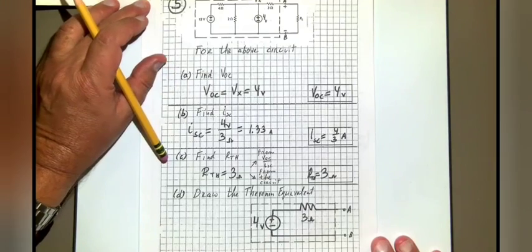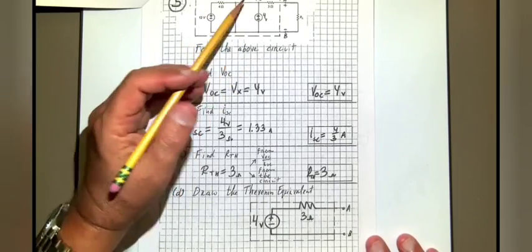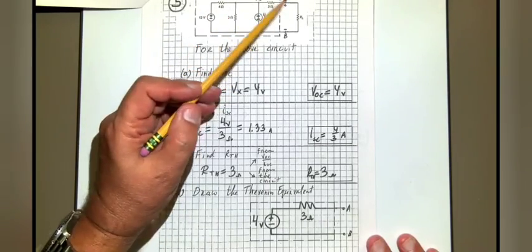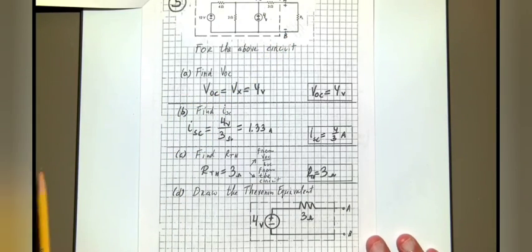Here, surprisingly, I received many different solutions. I gave you in the test the very basic case of Norton, Thevenin. No dependent sources, nothing, right? Just independent sources. And I asked, what is Vx? So, of course, we ignore this when we find V open circuit.